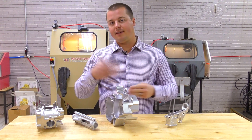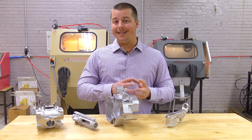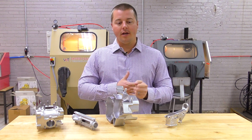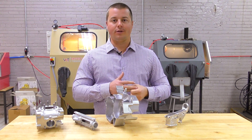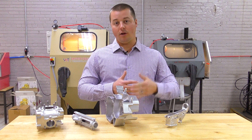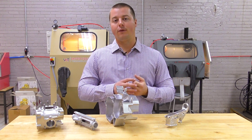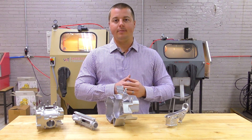If you have more questions on CFM and PSI, we're here and we can help you. The rule of thumb is three CFM per motor horsepower, and you can get a really quick idea, especially if you're looking at a used compressor. But be very careful on used compressors because you do not know how long they've been running and how hard, and how long each time they've been running, because the duty cycle directly affects the performance of the machine over its lifetime.